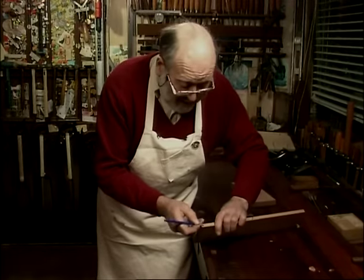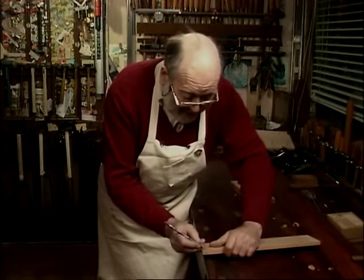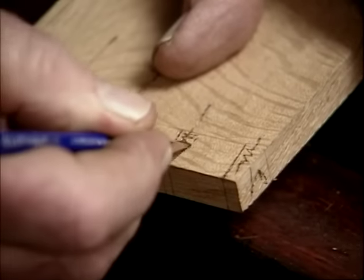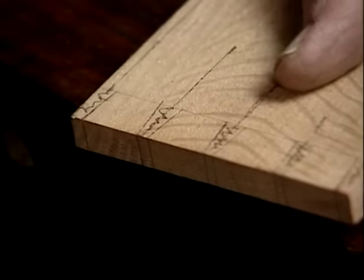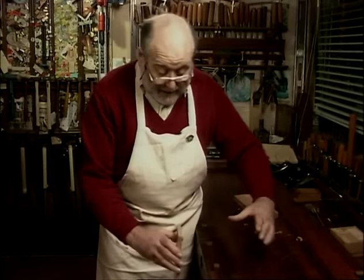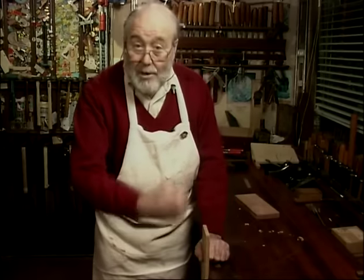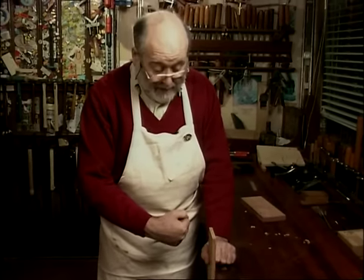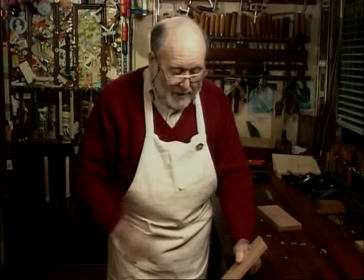It's most disconcerting when you get to put the drawer together and find all you've got left is pins everywhere. So that's what we're going to get rid of. We certainly wouldn't set all the drawer sides out individually — we'd set one out, clamp all the drawer sides together, square the lines over the top, and saw them all in one fell swoop.